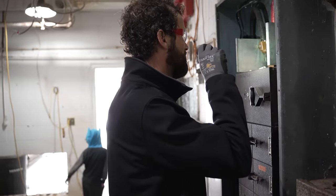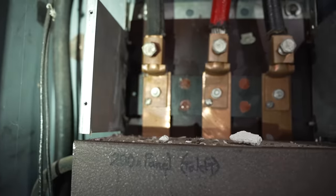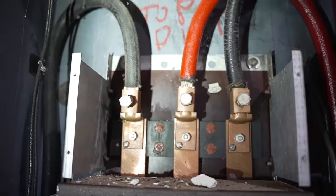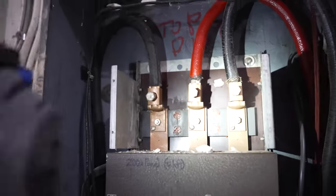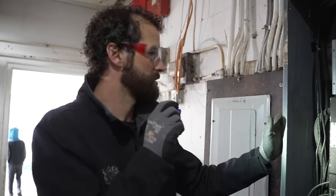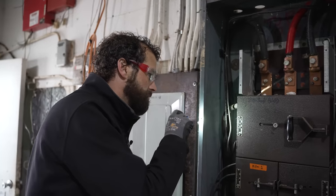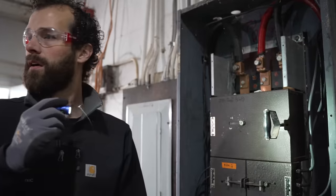I mean, this looks good, it's brilliant. Like people look at this stuff and they're like, what's all this crap, you know? Well, yeah, the cabinet's got some rust, but look how bright those connections are. There's no white chalky powder, no corrosion. It's actually pretty beautiful. Now the question is, in a moist environment like this where there is this much corrosion, how much internal deterioration in the breaker components that you can't access and can't replace? How much has there been? But at least the visible connections look really good. Obviously that's not perfect by any means.